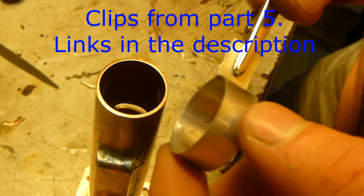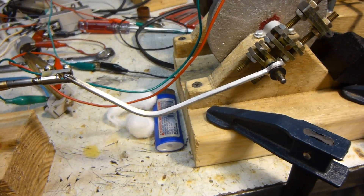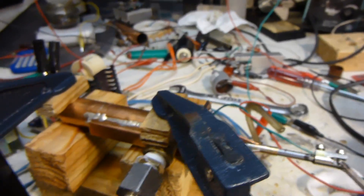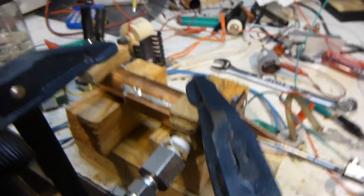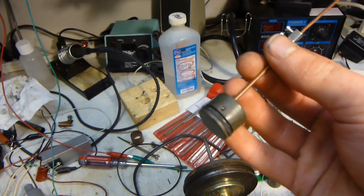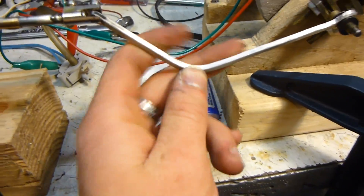Aluminum is great at keeping solder where you don't want it to go. That didn't go so well — I bent the connecting rod. It's actually kind of working now. Sadly I didn't make a video when it wasn't working, but basically before I didn't have any piston rings or anything. It had awful compression. I put a piston ring on it — basically an O-ring, just like how my steam engine is. And now I'm actually getting compression, and when it fires, it bends the connecting rod. So I think I need a slightly stronger connecting rod.